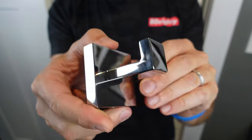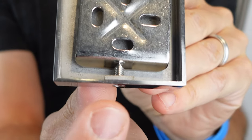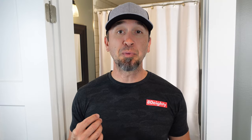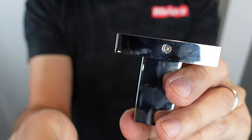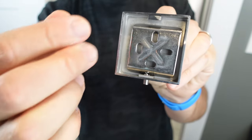First, let's get familiar with how these towel hooks operate. On the inside of the back of the hook you're going to notice that there is a plate in there that has four holes in it. Yours may look a little bit different than this, but this is usually what they look like. At the very bottom of the towel hook there is a pressure screw — it's a pointed screw that helps keep that plate in place. To remove that plate, take the allen wrench that comes with your hook, stick it in the bottom right where this hole is and unscrew it. You'll notice that as you screw it, the screw comes down out of the back of the towel hook and the pressure plate is released.